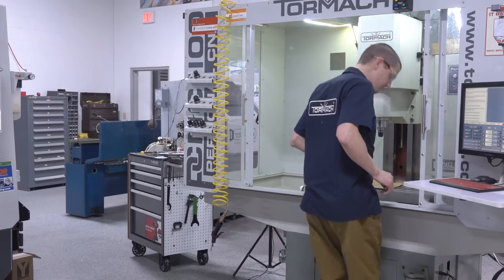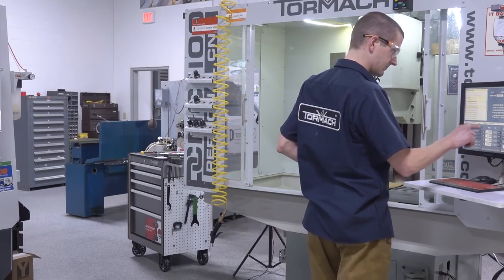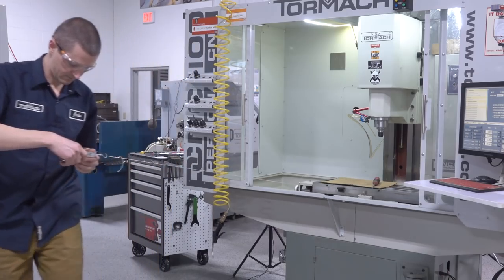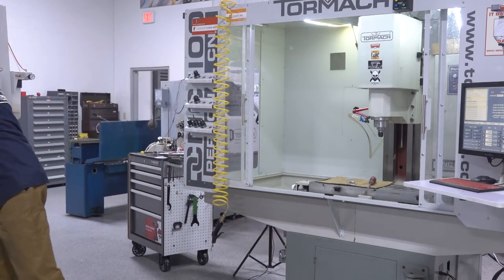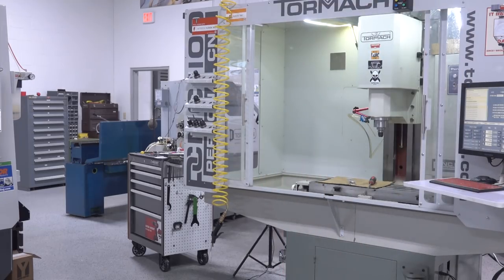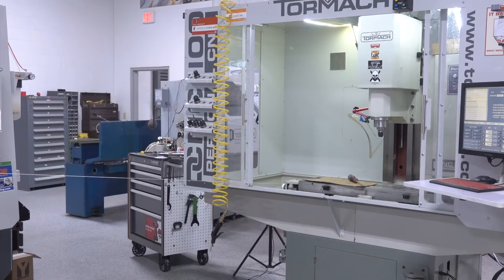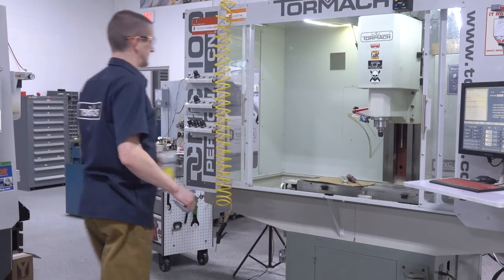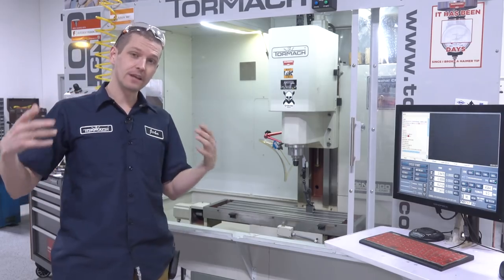Since I'm tightening the gib only right now, I'm going to take the right-hand screw totally out of play — I just want to be driving the left-hand screw in. When we're done and need to set the gib, we'll put that right-hand screw back in. The first reading after we started to seat that gib, the torque value increased from 600 to about 850. You can also use your feel — this is no different than a Bridgeport machine where your hand is a proxy for that motor. Does the table feel tight? You'll know if it feels too tight. Second pull after adjusting the gib a little more, we're now at a thousand grams. We're seeing that increase as we seat the gib. It feels snug but does move freely, versus when the gib is too tight you really have to force that pulley before the machine breaks free.